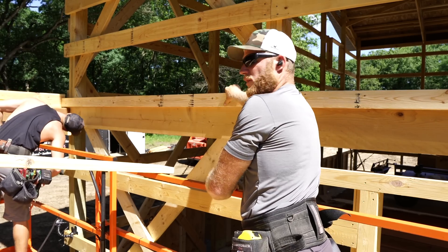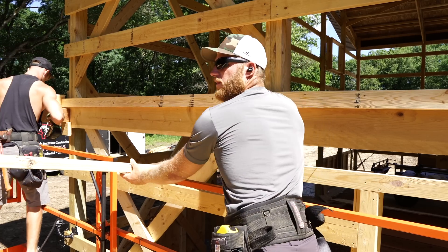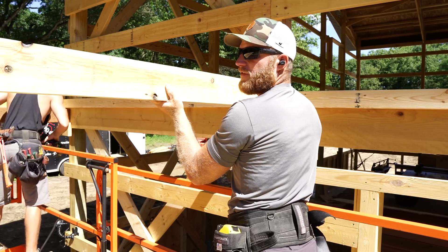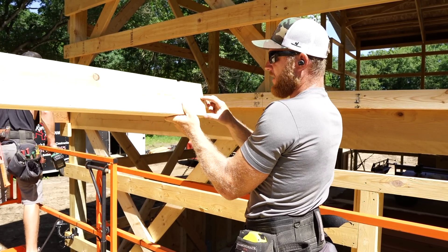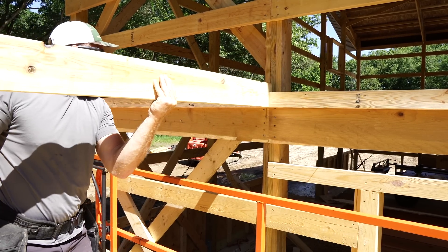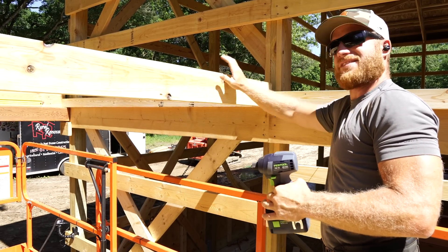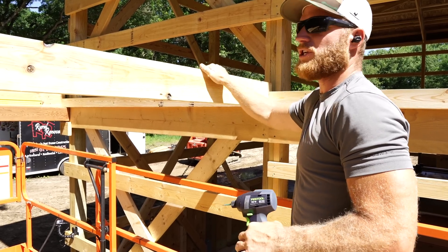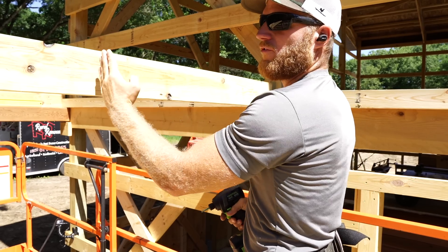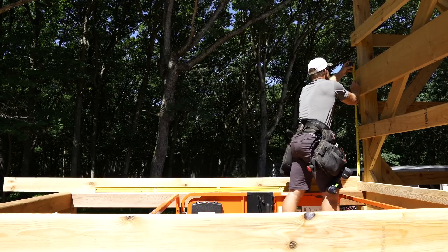Here we've got our ledger board that we're screwing into our 2x12 header, and that's what's going to support the ceiling but also the 2x6s that go out to create our overhang. What I've got to do is notch this inch-and-a-half by three-and-a-half so that it sits over top of this ledger board. This is not going to be carrying much weight at all — it's literally going to be carrying a couple sheets of steel which weigh 70 pounds per hundred square feet. We'll also have some perpendicular framing to support the span of steel at three foot four and five-sixteenths.